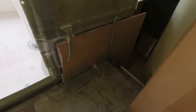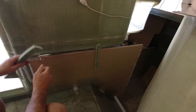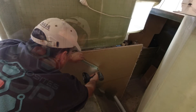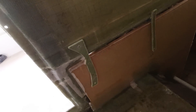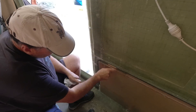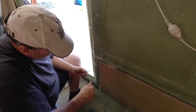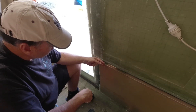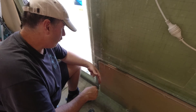I've got that in place now. I've just peeled the peel ply off that tab because I'm going to have to repair between where the cleats are. I'm removing these supports and then I can deal with this gap here — that'll be filled with vinyl ester and cotton flock to tie it back into the wall. I used up the excess vinyl ester I had to start filling this area, but it certainly wasn't enough. I'll fill this and then tab from here to here to make sure this wall is all one piece.